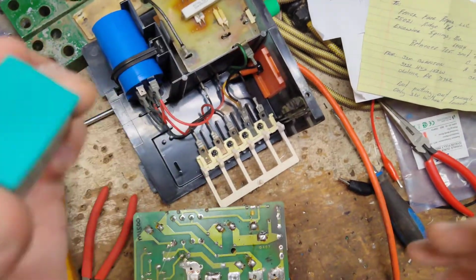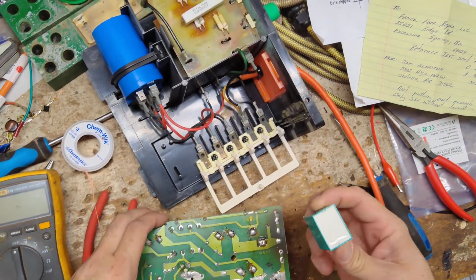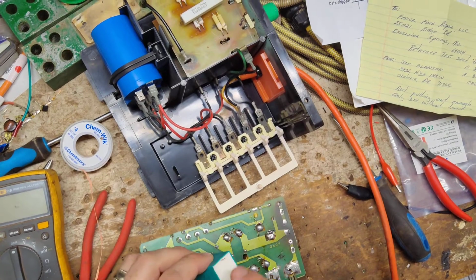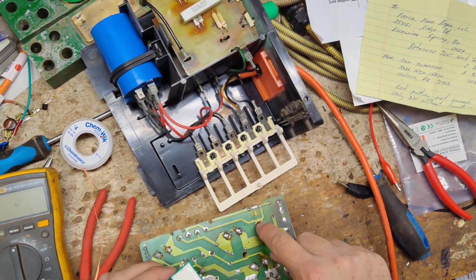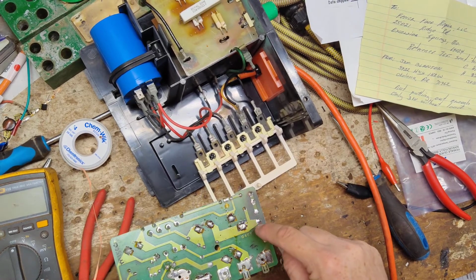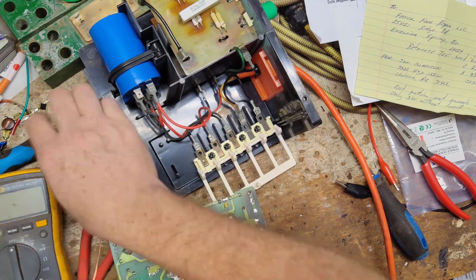Alright, this capacitor we're going to use is the same rating as those, just square versus round. But the holes aren't going to line up just right because this has a lot wider contact points than that one right there. So when we pull that capacitor, we'll have to drill a couple holes probably and run jumper wires to it. But that's not a big deal.